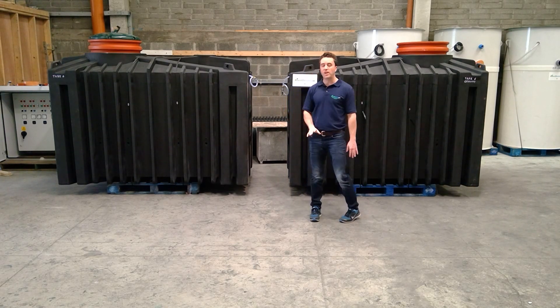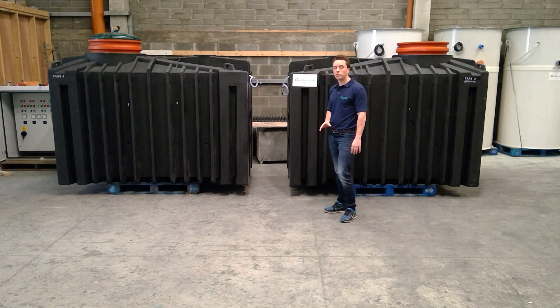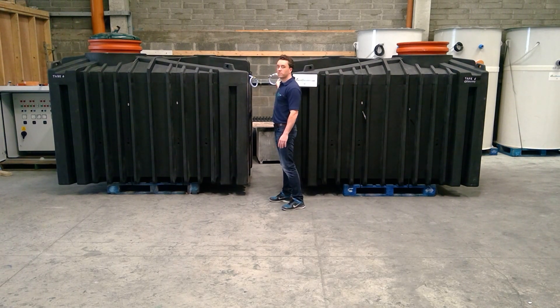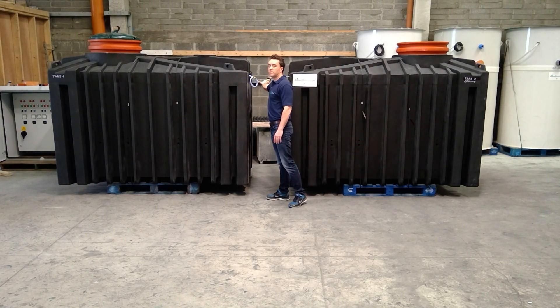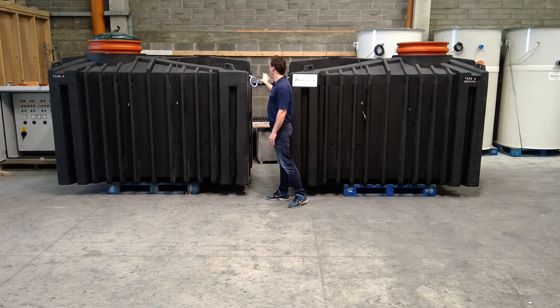Connecting them is a piece of cake. You just use four inch or 110 millimetre PVC pipework — the same pipework you would use in the sewers around your house. In the very top connection there is a piece of braided air hose. Before you make the connection on the top part, there is a hose tail on this piece of braided air hose, and you just connect this to the end of the air hose and fasten it tight using the stainless steel hose clips that we supply.